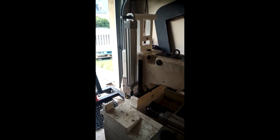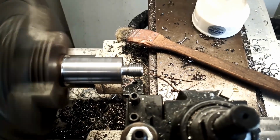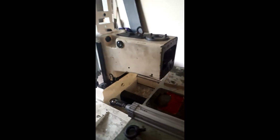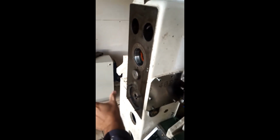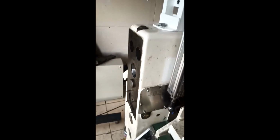So first thing was fitting again those two pneumatic jacks with a shorter travel. Not much to do, just a pair of adapters, although it involved trying to make a left-hand thread on the lathe with Centroid Acorn. And also removing this stock motor, which goes here on the back side and takes a lot of space on the back side that I cannot afford. So I really want it maxed out in Z minus. I want this to be as close to the wall as possible so that I don't waste space.